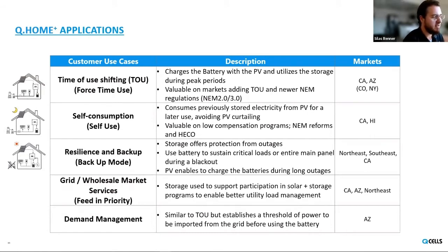The next mode is self-use, a very common one. The whole idea is to avoid PV curtailing — if the utility company doesn't give you much for putting PV energy back into the grid, it would be more valuable to put that into your battery to use at a later time. That is what self-use is for. It basically minimizes the output to the grid so that if you're not getting much from the utility company when backfeeding, you can prioritize keeping your energy localized to your Q-Home system, ultimately saving yourself some money.